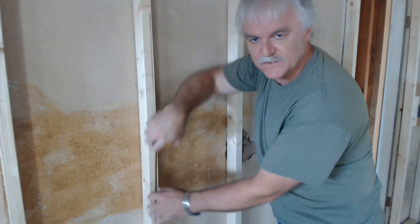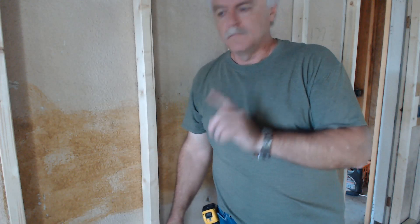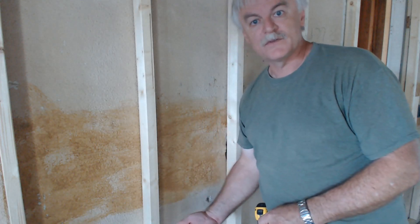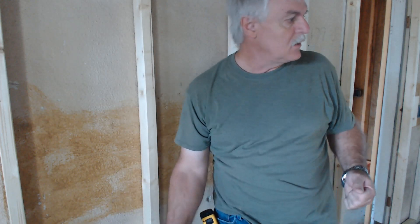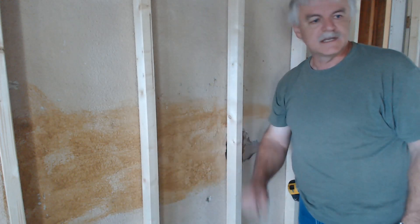That'll be above the finished floor, so if I was putting tile on here, I'd add a half inch. My receptacles on the floor will generally come up 12 inches off the floor to the bottom. It's not necessarily the right way or the wrong way — some people put them at 16 inches. We're going to do 12, then 42. Let's get started.